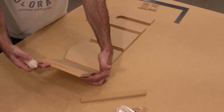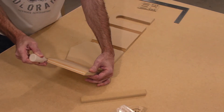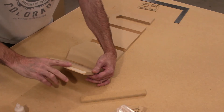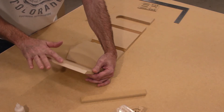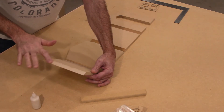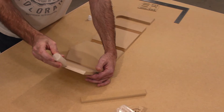For the final side we need to glue one of the sides — lift the side panel up and apply a bead of glue to the center. Using your finger, just tap to spread the glue out a little bit and then spread it so you have your film. You want to make sure all surfaces are wet — that's going to help protect the birdhouse in the long run. If something is dry, add a little more glue. Then take a bead and run it down closer to the inside of the panel so we don't have too much squeeze out on the outside.